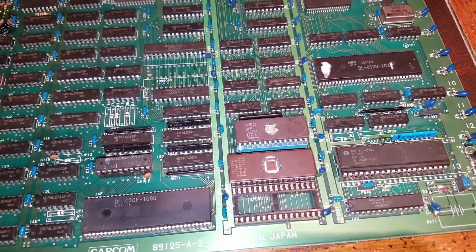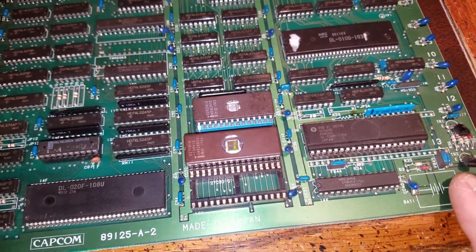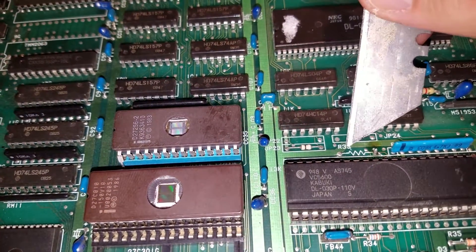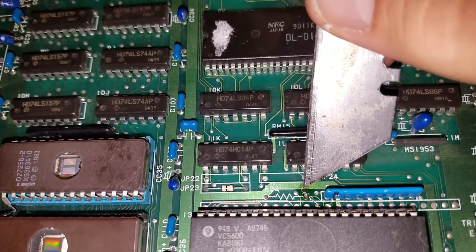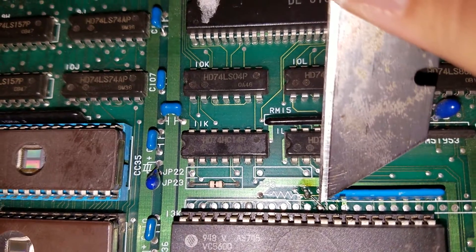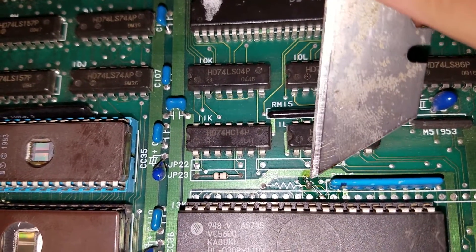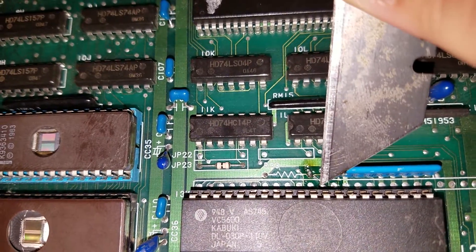I'm halfway done with the PANG board. I took off the battery because it was obviously dead — that's why this board suicided. Additionally, you can see R33 right here. There was a resistor from here to here, so I removed that resistor. Then after removing it, I soldered in a wire from here to this pin here. I'll clean it up and get the flux out later.